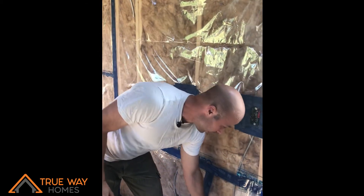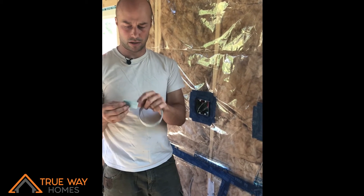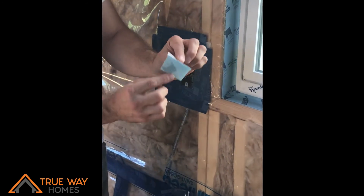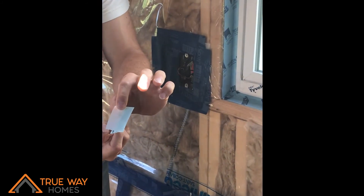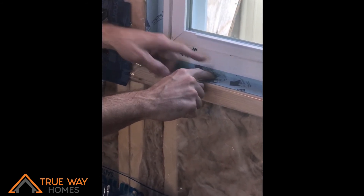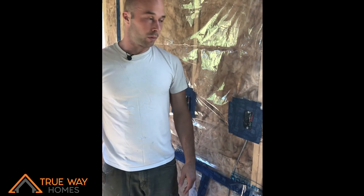The other tape we use for all the seams is also from Proclima — it's the Tescon Profect. What's cool about it is we use it around all the windows. As you can see, I took a piece off — it's pre-folded so it has a sticky side and another sticky side covered with non-stick paper. You put it right in the corner where you want it, stick one side down, peel off the paper, and use a tool to press it tight into the corners. It makes things go so much quicker, so it was definitely worth the extra cost. That's the solution I came up with for the vapor barrier on this tiny house — if you like the video, please share it to help us get the word out about healthy building practices. See you next time.